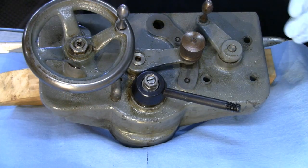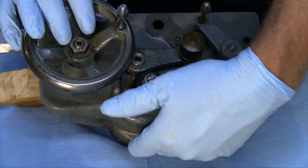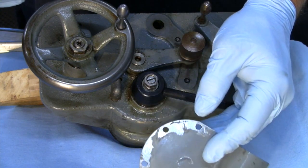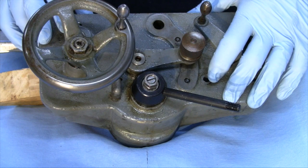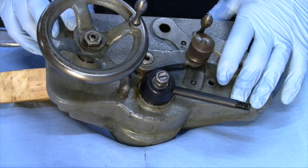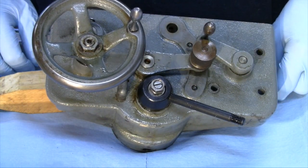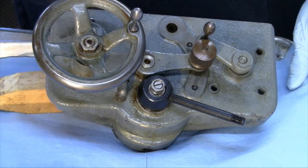We got the apron back off. It turned out I was able to fix the leak from behind - we put a gasket on there and it didn't leak. But then when I tried to operate the power feed and the clutch, when you disengage, the power feed would continue. It's supposed to go off right when you disengage. I got to thinking it's probably been sitting in storage - this little lathe has been moved several times - and it probably needs a good cleaning through the clutch mechanism. So as long as I'm doing that, let's go ahead and add to the body of knowledge of Logan lathes and tear it down and take a look at it.